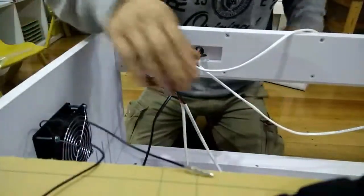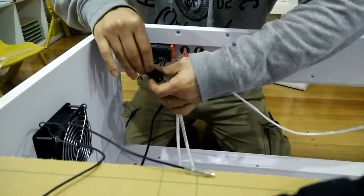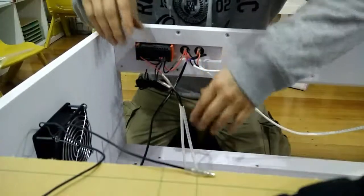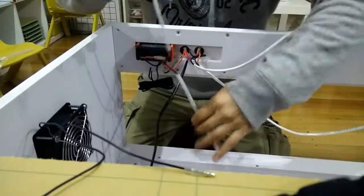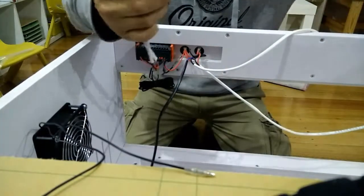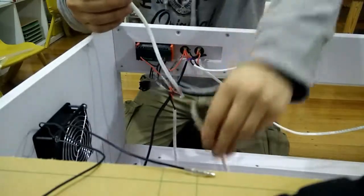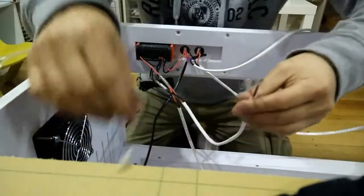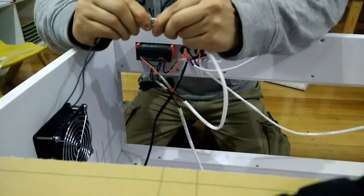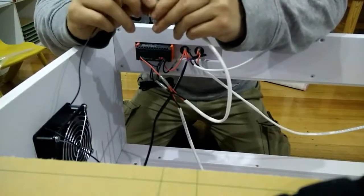So that's a fan. So at the back of the thermostat you have this wire all bunched up with the probe. So this is the actual sensor. So this can be placed strategically in your Brooder box. And coming on the back of the Brooder, there are these wires, which are in a white PVC case or tube. One long, as you can see, and one short. Grab the short one, and this is the wires from the fan, and just match it up. Doesn't matter which goes to where, just as long as they plug in firmly, and then there's a rubber sheath that overlaps to protect it.